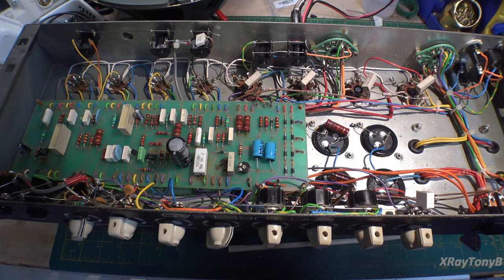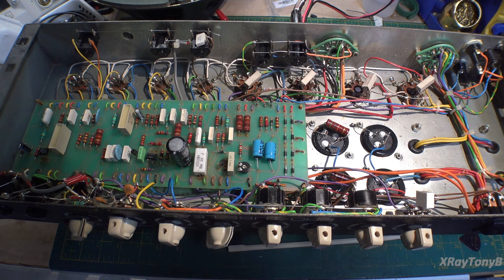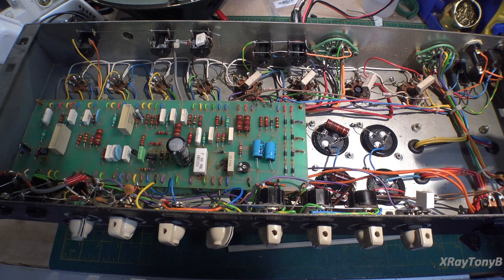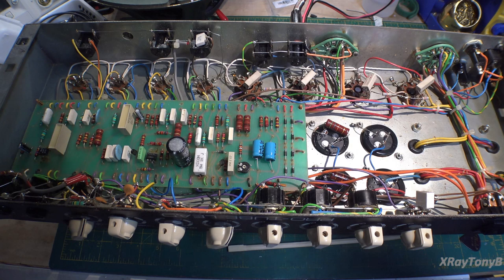Here we are with the underside and it doesn't look as good as I thought it would. One of the interesting things about this amp is the AOR — Advanced Overdrive Response. What it is, is they're using some circuitry to switch in an extra gain stage, so the amp can actually be two different types of amplifier: one with a less aggressive overdrive, or one of those really aggressive overdrive amplifiers, just with the flick of a button or step of a foot switch. I'm starting to learn how they're doing it by looking at schematics of other AOR amplifiers.